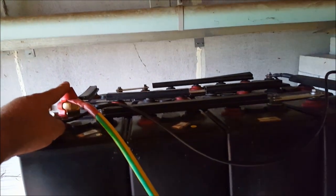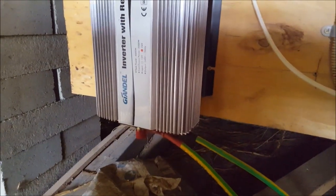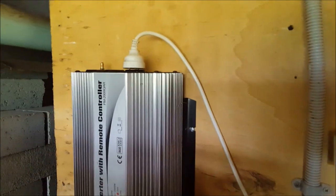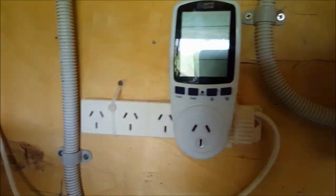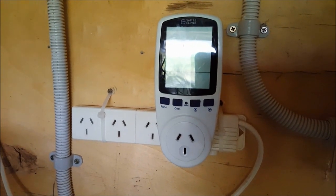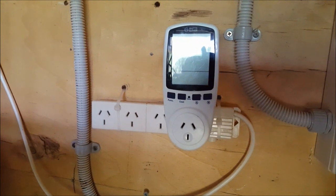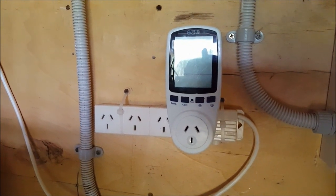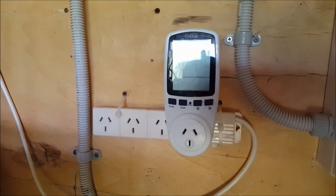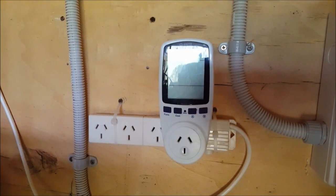I've got 35mm square cable coming from the batteries, with my fuse block there, into the 24V to 240V inverter. At the moment I've just got that going to a power board and my kilowatt meter. In the next few months I'll get a new distribution board put in the main meter box and run power from there — I've got some plans to keep the wiring nice and tidy.